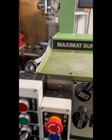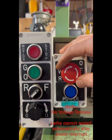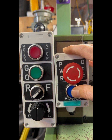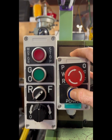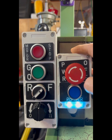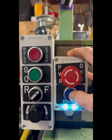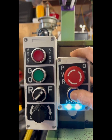Now let's go down to the control panel. Power to the system is applied via an NVR relay. When I pop this latching button out, it enables the power button — a momentary button that applies power to the NVR relay. You can hear the relay click. The beauty of this is that any power interruption removes power to the whole system, including the VFD, and it's quite easy to hook up additional interlocks, like for a cabinet.